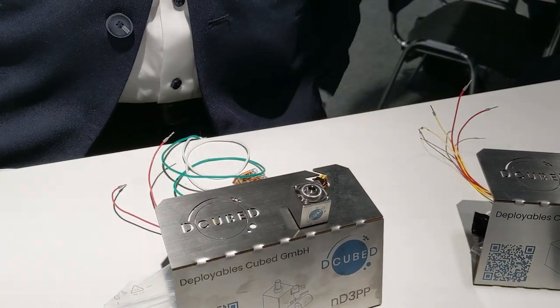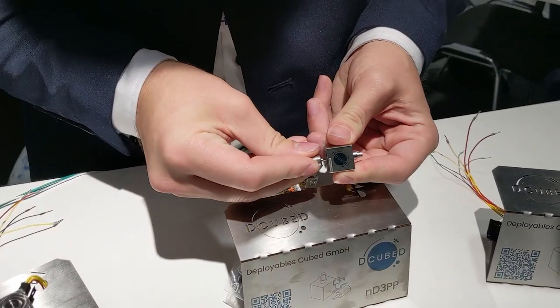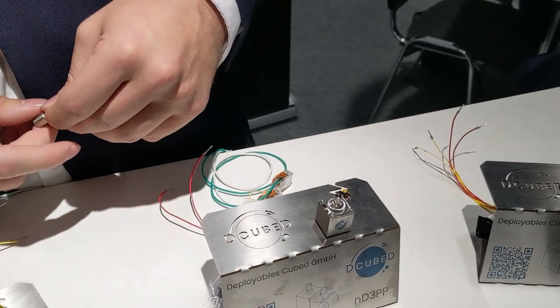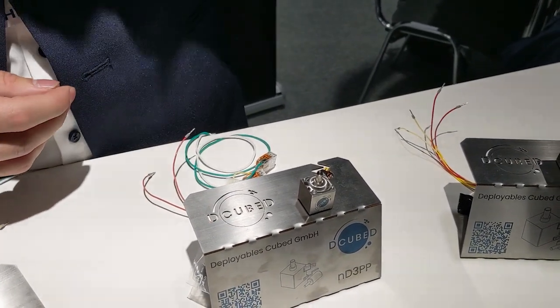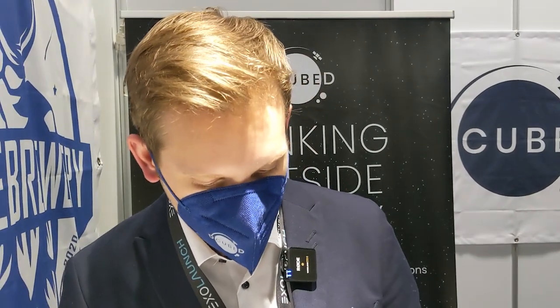One of the beautiful things — I don't have a reset tool on me very easily. And there, it's reset and ready to test again. In space, one of the critical things is testing the same hardware on the ground that you're going to fly, so you always want to be able to test, reset, and test again before you fly. Every minute you waste testing is a lot of money spent on test facilities — for example, when you have a TVAC chamber booked out. Some other devices take hours and hours to reset, and that's money you're just throwing down the drain.